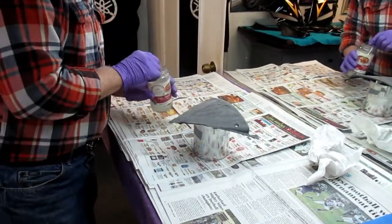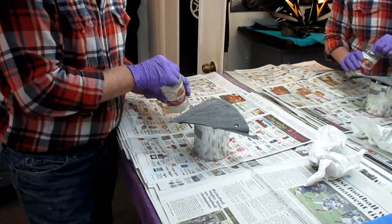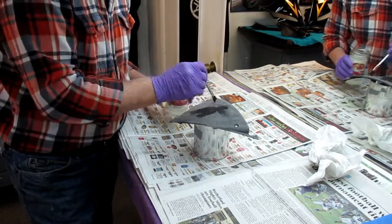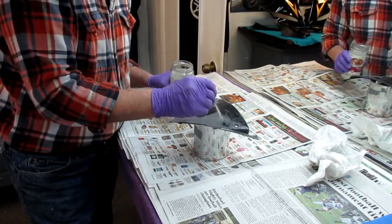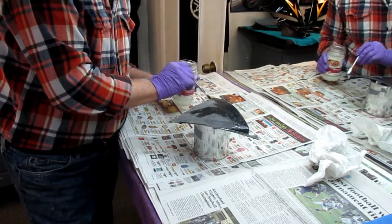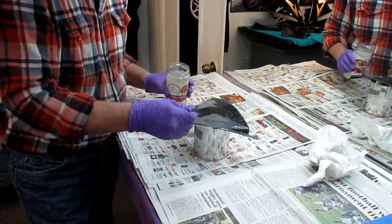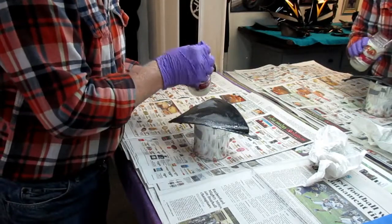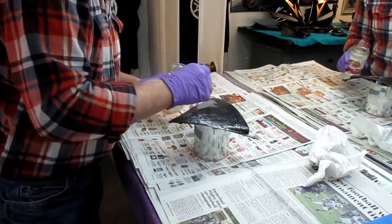Okay, now some part of this might get boring, but there's 2 phases to this. We have a phase of about 45 minutes where this resin is going to stay at this temperature. It's going to stay totally liquidy. During this phase, I'll be able to just brush it on, brush it off, do anything I want. Then it's going to start to get tacky and gluey, and then I have to really be careful to press down all the corners and edges and angles. And when I'm all done, I'm going to have to trim off the extra, and then very carefully grind anything off of these tabs, because this is going to have to go back in with tabs, of course. So a little bit of patience is always in order.